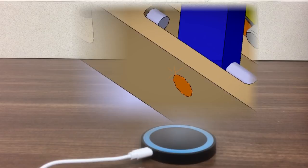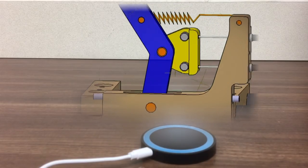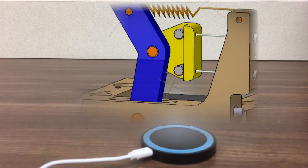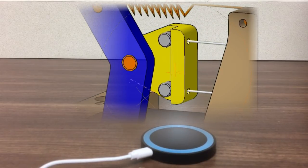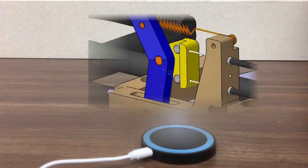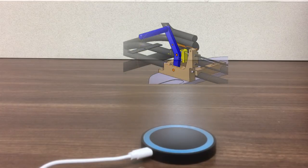Then further up towards the top there, you can see where the brake cables go in. These are just standard bike brake cables. They will go to the rear brake discs. And then just ahead of them, we haven't made that yet, but that's the brake balance bar. It's a triangular shaped object. So when you press the brake, it just pulls on those brake cables and actuates the calipers at the back. Fairly straightforward.